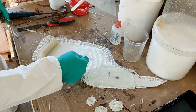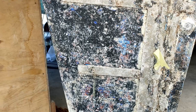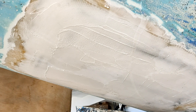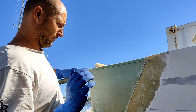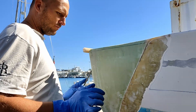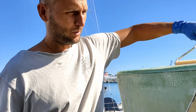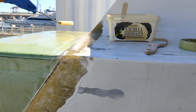How do you know when you've got enough resin on it? It goes clear. Here is the repaired starboard hull above the rudder, and here is the repair on the port side, which still needs the glass on top. We've had a bit of a distraction — there's a transom going on, a bigger transom than before. I had to get inside the boat to do the repair, so I had to chop the transom out, and when I put the new one back in I modified the design somewhat — but now we have a nice step.